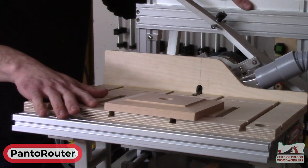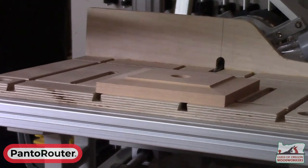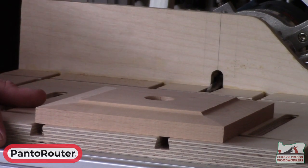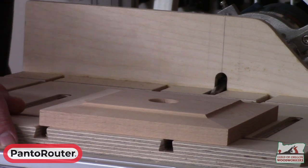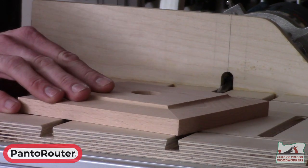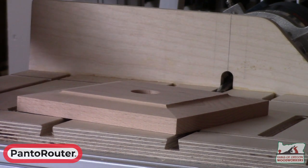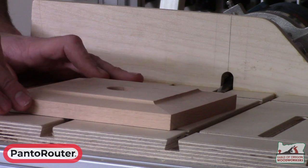The beauty of a setup like this is I get to determine the angle of this bevel just by tilting the table. What would have been a pretty specialized router bit — often these really shallow angles require pretty large router bits, you need a big router in your router table, and you're spinning a lot of metal, and they're only good for that specific angle. Today 8 degrees felt appropriate, but tomorrow maybe 12 degrees feels appropriate, and rather than stocking every single angle I can just tilt my table slightly and get the desired results. It really does give you quite a bit of versatility.